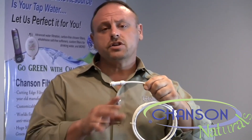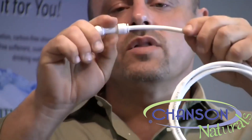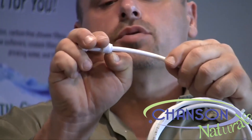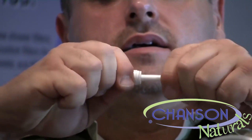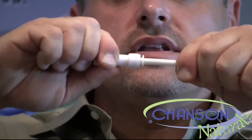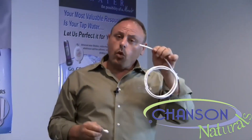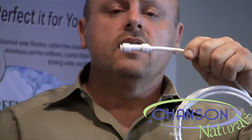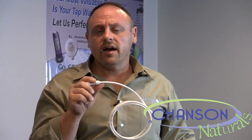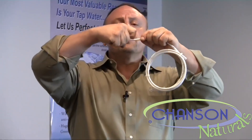These are some of the most advanced plumbing connections in the entire plumbing industry — it's called quick connect. They almost never leak and they're just as solid as metal connections. The only way to get the tube back out is to take your fingernail and push down on the outer collar and pull. Push in all the way until it won't go further — that's how you know it's in. To remove it, press down on the collar; you might need two fingernails. If there's water pressure in the line, turn off your cold water supply under the sink, then come up top and turn the power button on the machine to release water pressure before removing the line.